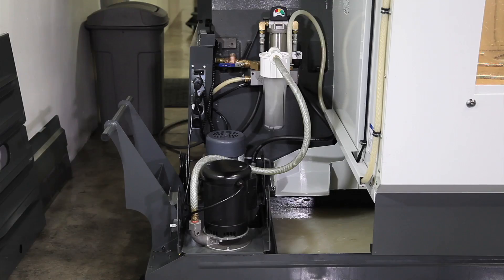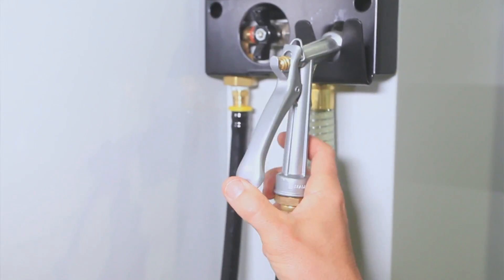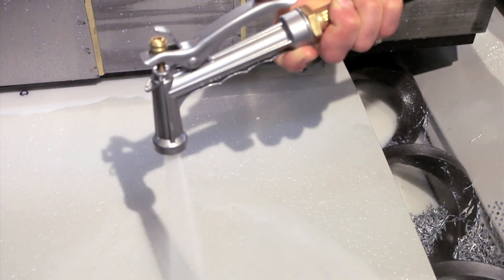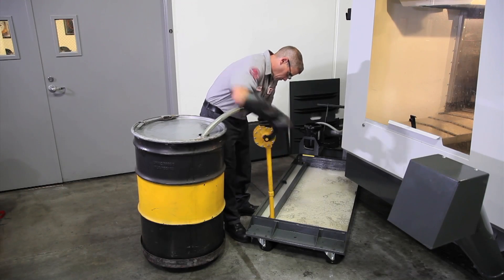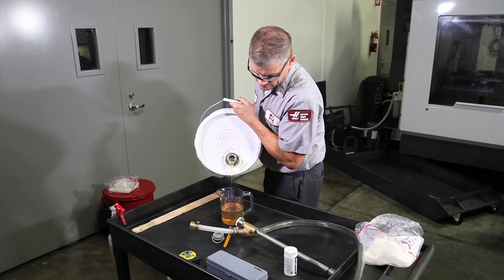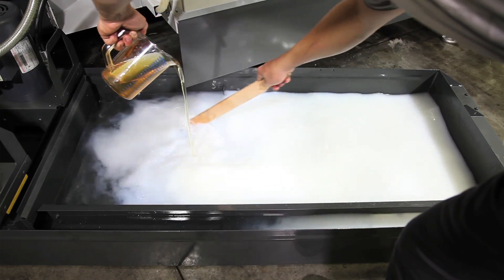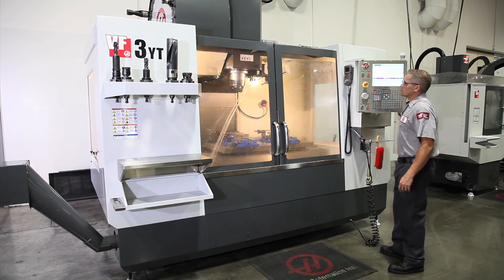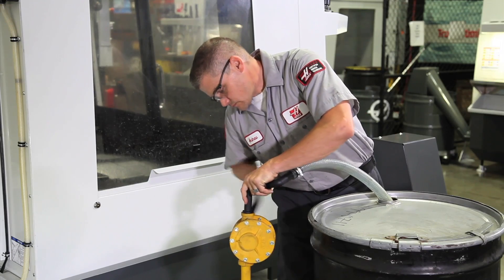Partially fill the tank with a four percent solution of water and alkaline cleaner, then run the coolant system for two hours. Make sure all the pumps are operating. Be sure to empty any areas in your coolant system where contaminated coolant may accumulate, like the wash-down hose on our machine for instance. Don't leave the alkaline mixture in the machine — you need to pump it out, then rinse the system with a two percent coolant solution for 30 minutes. Pump out the rinse solution; your coolant tank and plumbing are now ready to be recharged.